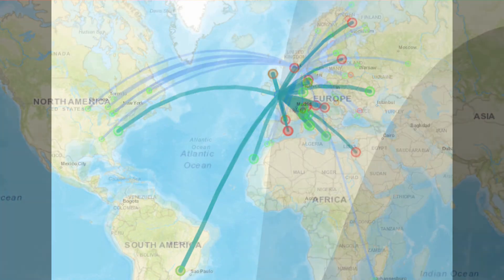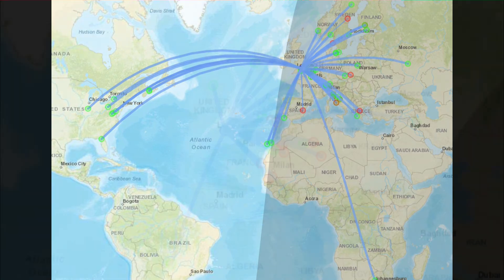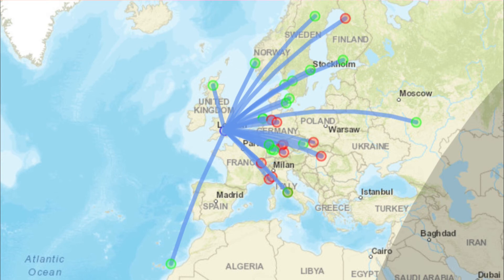On to 30 metres. This was with it horizontally from my last video — you have already seen this diagram. Again quite a nice omni-directional pattern, quite a few out in the States and a couple in Canada, all around Europe, and even one down in Johannesburg. Now the diagram from this test with the antenna set east-west: okay, maybe the bulk of contacts are out to Germany, Poland, out to Moscow — but there are a couple of anomalies towards Scotland, going straight over the top of Spain. So I am starting to question its directivity, to be honest.